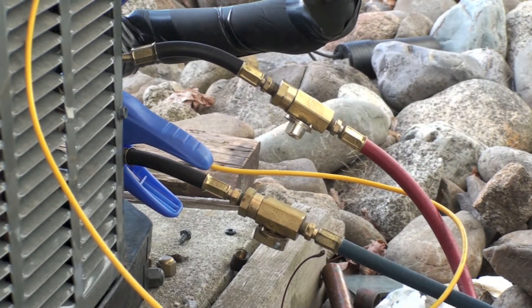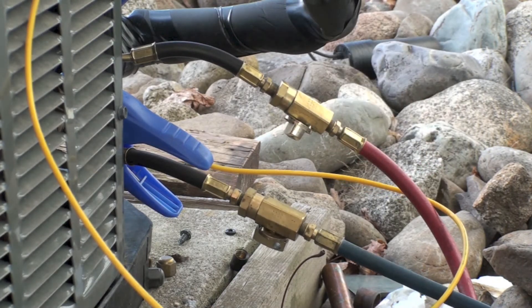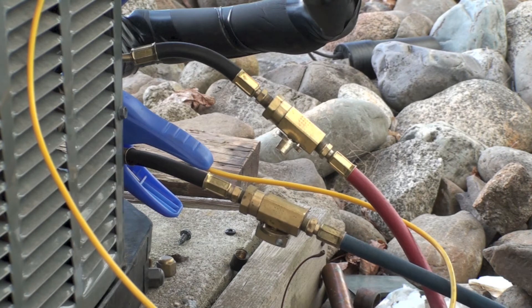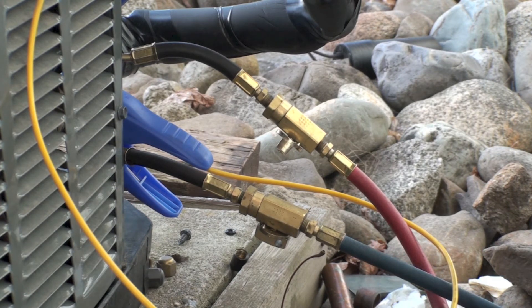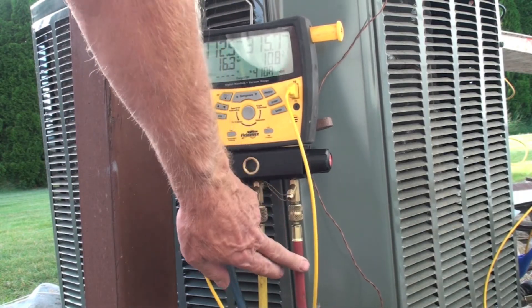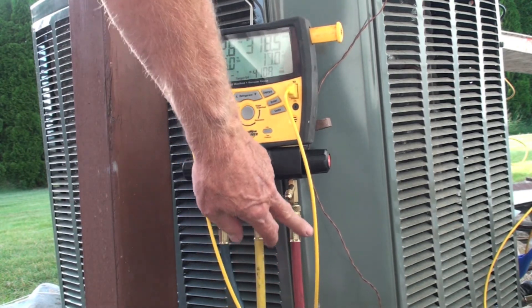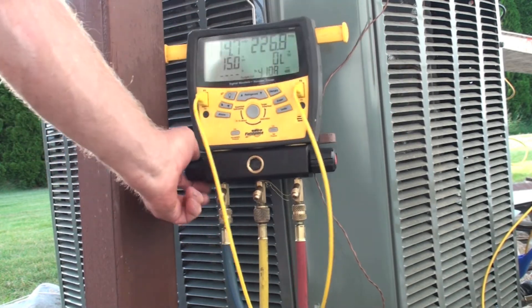Then I shut it off. Now there is no continuity between here and here. This red line has liquid refrigerant because it's on a liquid line. If I take and open the suction line side and the high side, this line has liquid in it — it's also at high pressure, showing 300. Now I've got the valve off, so it's probably going to be a little lower. I can suck all this liquid out of here simply by opening this valve and opening this valve.